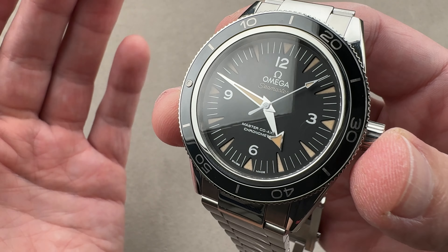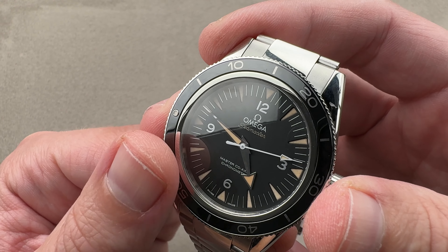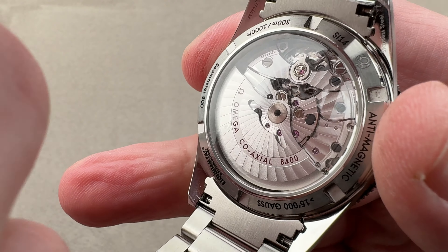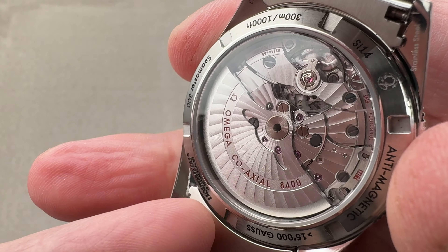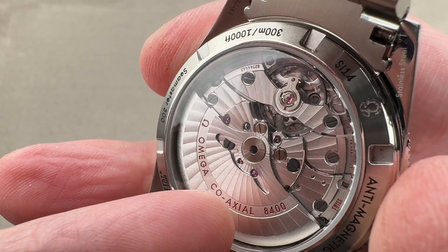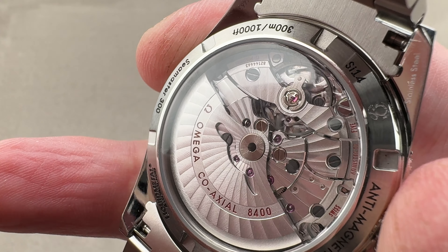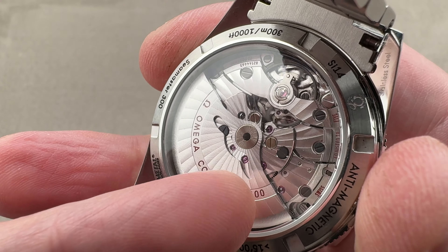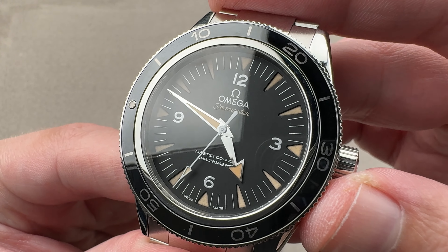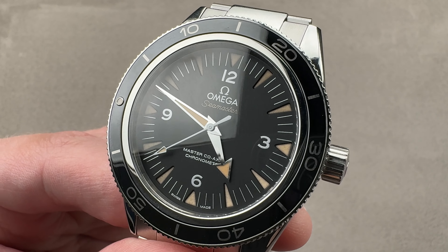There is a lot to love about this watch. Though nostalgic, it is very much a modern timepiece — a 38-jewel movement with a very modern finish. If you take a quick look, you can see on the reverse side these spiral arabesque Côtes de Genève, machined but handsome bevel on the edge of the bridges, both polished and blackened screws, satinated wheels, and engine turning on the base plate. Though this is a machine-finished movement, it is attractive and fun to look at. If you love this watch, reach out to the team at the1916company.com for purchase and pricing details.